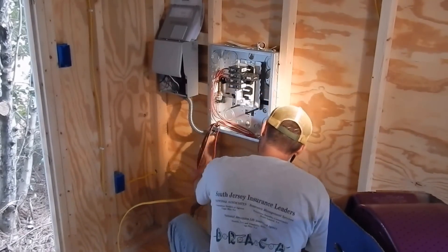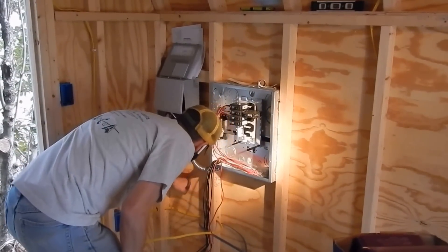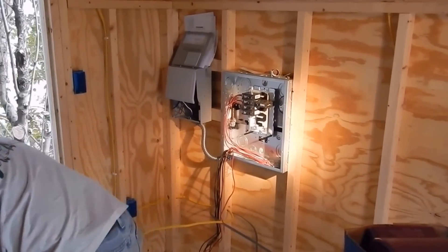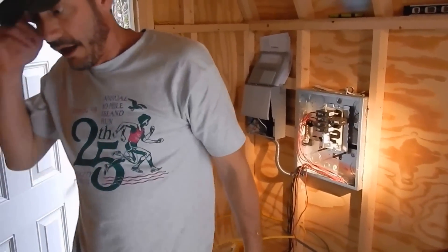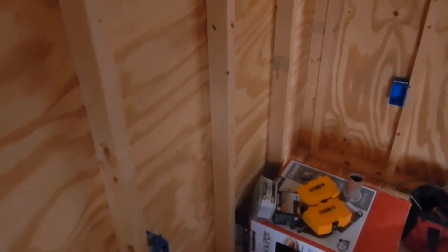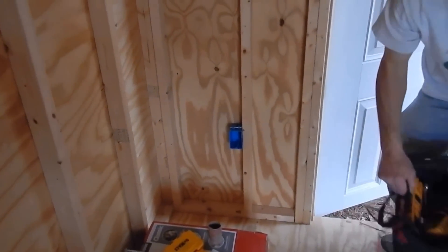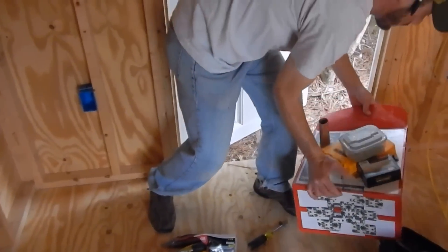He is drilling a hole to run a wire. Because of this corner here, I'm just going to bring the wire back down and re-utilize this, then bring it back up. We're drilling up — I've got to connect this box to this box, so I've got to drill through these studs here. Yeah, man, don't mess up our little house.